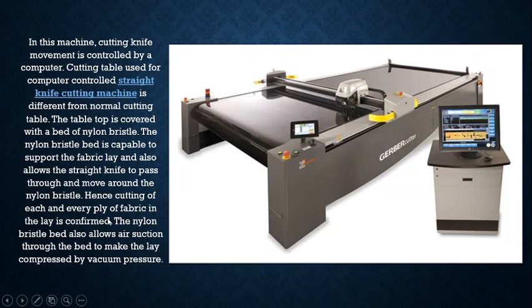Okay, the nylon bristle bed also allows air suction through the bed to make the lay compressed by vacuum pressure. So in this instance, we don't need to clamp or shrink wrap or anything with our fabric, because it has these little vacuum suction cups or valves right here that suction the fabric down to the bed to hold it in place while it gets cut.